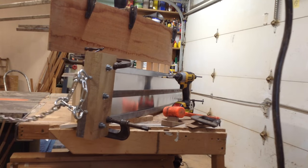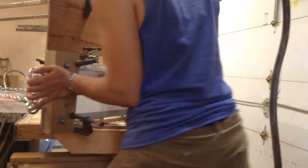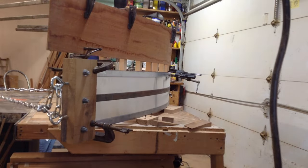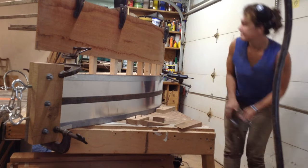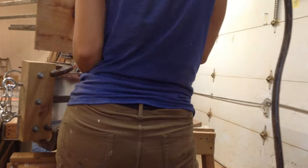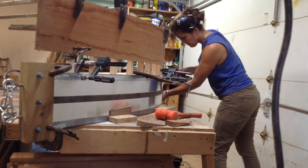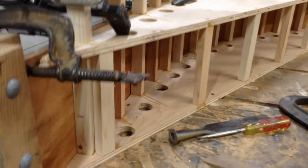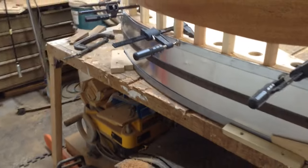This is the second piece out of the box. I put the wedge in the center, put the clamp on top, pulled my chains to the strap, and started bending. There are a lot of times I have to make slight adjustments, but since the first one bent — even after that long time stuck in the steam box — I was pretty confident this one would work too. I'm just making sure everything stays flush on the table. You can see this is actually pulling my table saw, that's how much force is being applied. Once it was in rough shape, I went around and clamped everything.